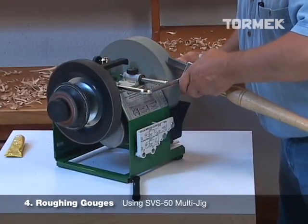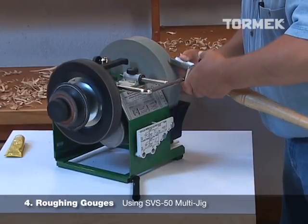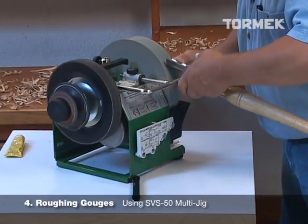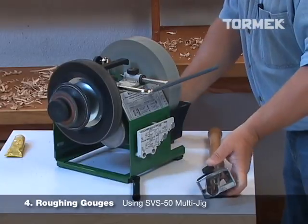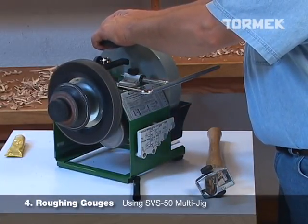Once you've gained some experience with the system, you can become concerned with minimizing stone wear. In the beginning, concentrate on your tool. Shape the tool with the 220 grit cutting action. Then, use the stone grader to polish the grindstone to 1000 grit.